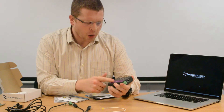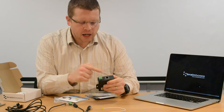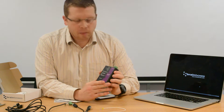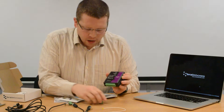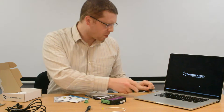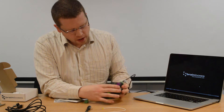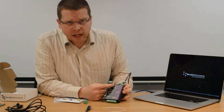This particular product is an ED008 — it has 8 I.O. lines, and each I.O. line has an LED on it. At the top there is an Ethernet jack and a power jack. When you first take it out of the box, the first thing I would recommend is connecting the power. The power is on a terminal block with a minus V, plus V, and ground. Conveniently, you can buy an accessory from us to power the device from USB, which is very handy when configuring it for the first time. I'll plug the USB into the laptop and the terminal block into the device — as you can see, the power light comes on straight away,